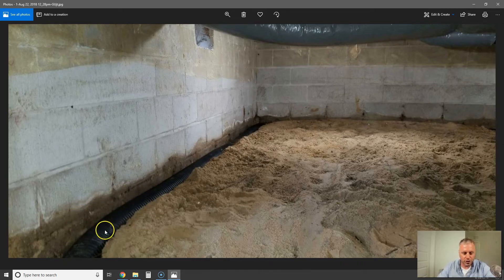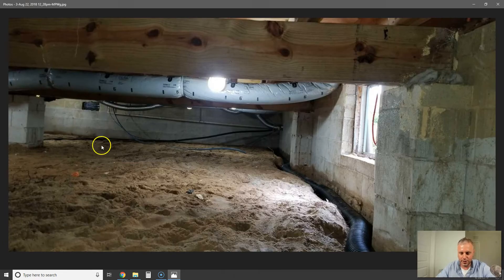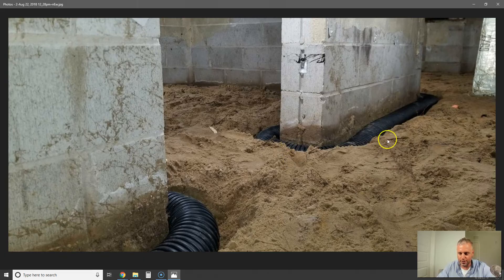This one has a tiny footer in there. There is gravel laid all the way around after we dug the trench deep down, and then we put in this four-inch perforated pipe. As you can see going through here, it goes all the way around — this is to carry the water to the sump pump. It's extremely important that this gets done.